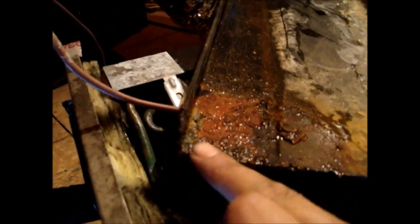So far so good. Line set goes up and over. Here's our pan — there wasn't much holding that together. As soon as I gave it a little pull, that sucker broke clean off. I can tell from all this trash in here that it had been more than just this little fracture. We got that out. We got the new pan, we're going to put the pan under this coil.